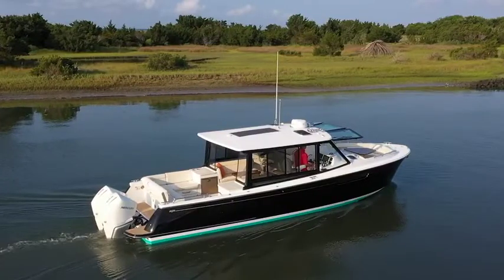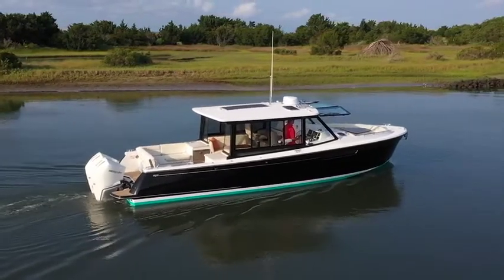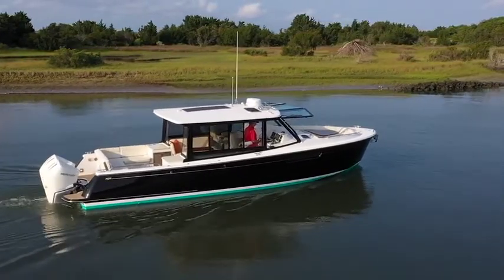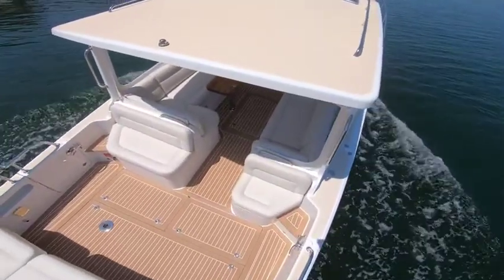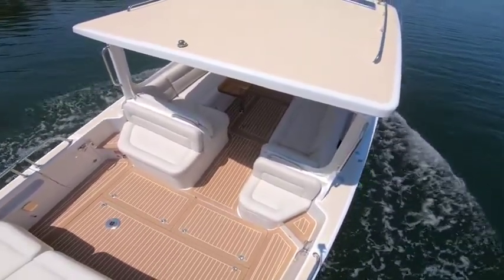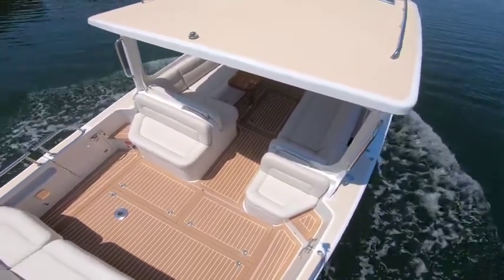And so we treat the deck, the grid, and the hull with that philosophy, that we're going after every aspect of extra weight, whether it's in the fabric or the resin, because it doesn't help the strength of the boat. It doesn't make the boat any better to have a resin-rich laminate. Fiber being much stronger than the resin that holds it together, it's to our advantage to drive the resin down, providing you have good vacuum.